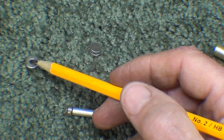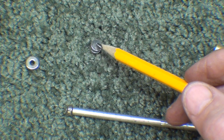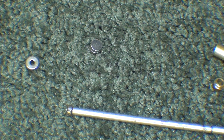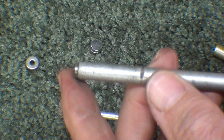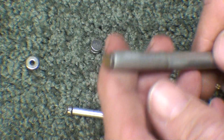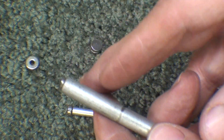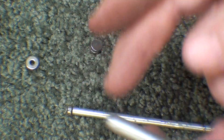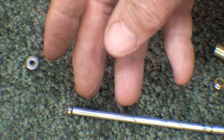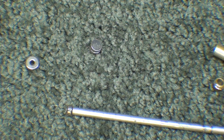Some of these magnets come with a hole in them; some do not. You cannot drill a hole in them, so don't even try — they're very hard and very brittle. I thought about robbing the magnet out of some other tool, like this pickup tool, but then I'm robbing Peter to pay Paul. In fact, I think you're better off with a weaker magnet than these neodymium ones, which are so strong that I have trouble with chips crawling up the tool, as just shown a few minutes ago.